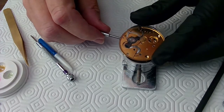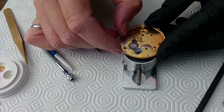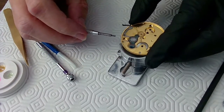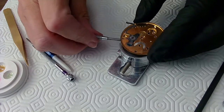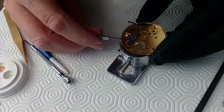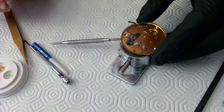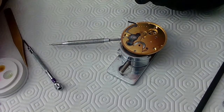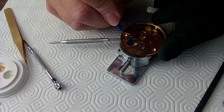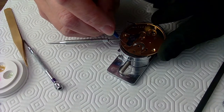Yeah, it's turning the gear, so I'll be winding the watch. And let me pull this lever set mechanism out with my thumbnail. That's the handy part about having thumbnails and stuff, by the way, because you can do that and make sure this is meshing properly. Still feels a little bit, no, it's meshing. There's no problem there. I think I want to put a little bit more oil. I'm going to put some oil on these gears because I think that the gears are a little bit rough without the oil. And just go down a few gears here and make sure that's oiled well.